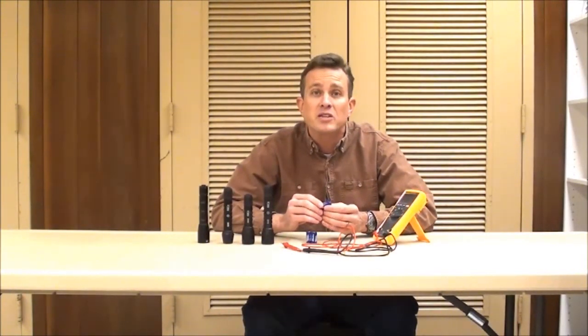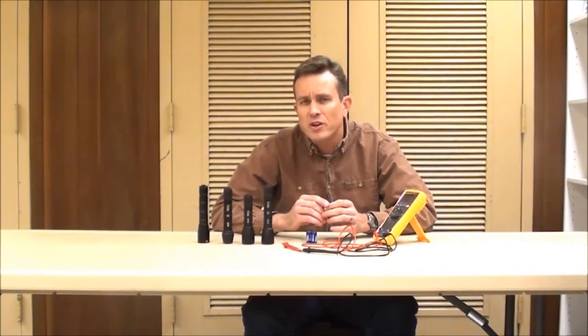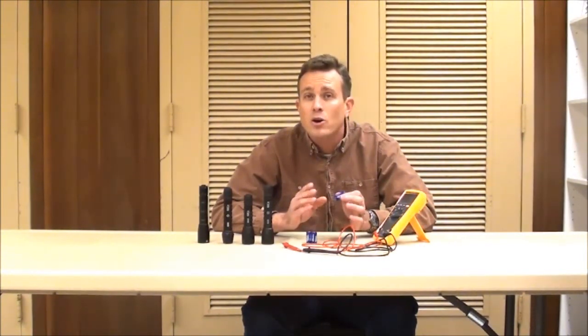All LZM modular flashlights are designed to fit well within the specifications for CR123A lithium batteries — that is, they never exceed the 1.5 amp maximum current draw from the batteries. We're going to demonstrate that here in just a minute, as well as show that sadly many other manufacturers take great liberties and exceed the maximum current draw that should ever be drawn from a CR123 lithium battery. We're going to show you a quick test on how you at home can test your flashlights to make sure they are safely drawing no more than the maximum allowable current.